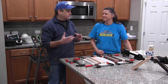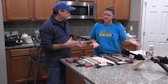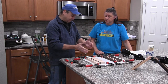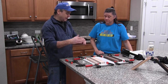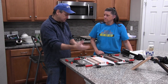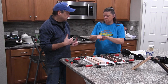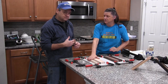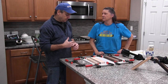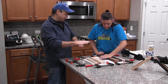We're back inside because it's too cold in the garage for the glue to work effectively. The glue works best above 55 degrees so we just moved everything inside. When we did the shelf for the smoker we had strips of wood that we were gluing together, and we sandwiched them between two pieces of scrap wrapped in wax paper to make sure the pieces didn't walk. Since these are so small, I think we're going to get away without that.